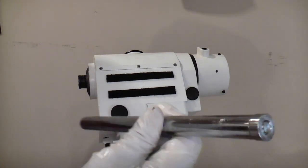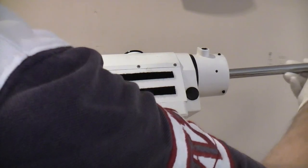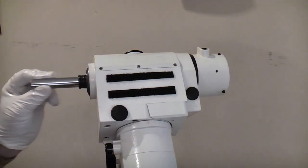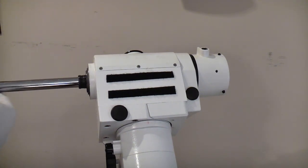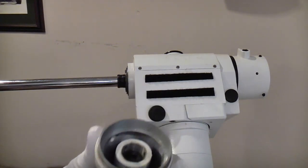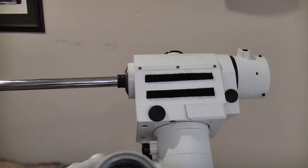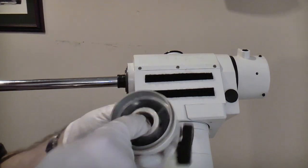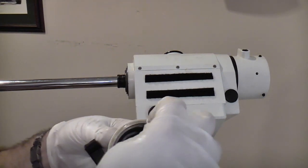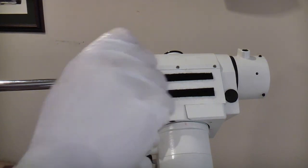Now I'm going to put back the counterweight bar on the top, making sure it's the right way around. Obviously want the threaded hole at the bottom where the little button goes. And now the white collar, we need to refit the green graticule ring onto this. Apologies that I'm slightly off camera there. Just greasing the thread on there, putting a little bit of grease where the green graticule ring goes so that it turns nice and smoothly.